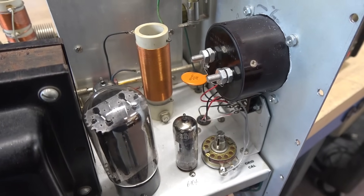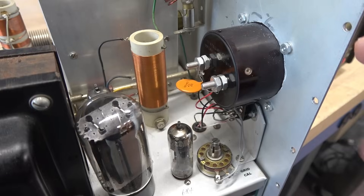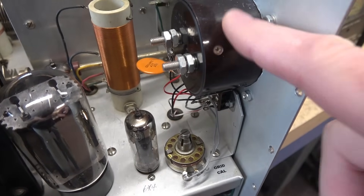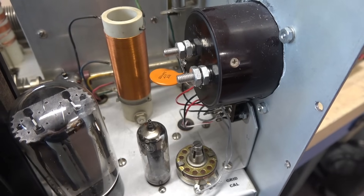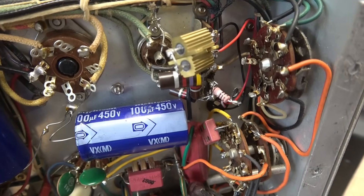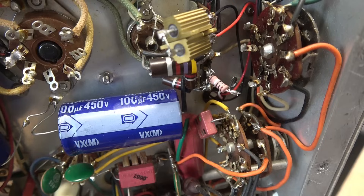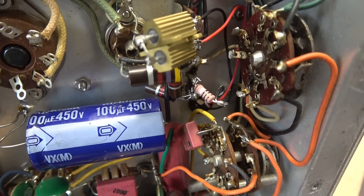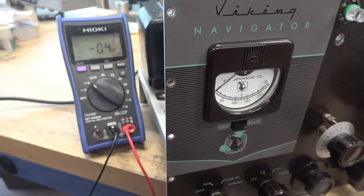The value of that shunt resistor was tricky because of the resistance of the meter, so I added a grid calibration pot — an adjustable shunt value in parallel with the meter. Underneath I installed a 1-ohm resistor in series with the grid line going to the meter for monitoring current to verify calibration. You simply clip across that resistor and measure millivolts, which equals milliamps, then adjust the pot until the meter reads what you see on the DVM. With about 5.5 milliamps showing — it is calibrated. You can do the same thing with a Ranger meter; you'll see all of this on my diagram.